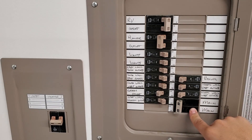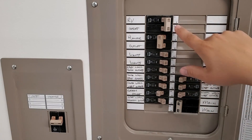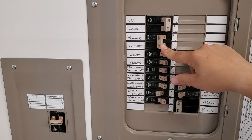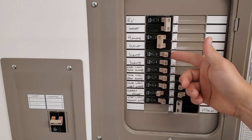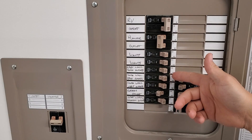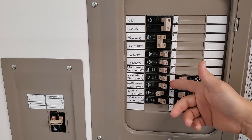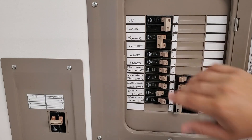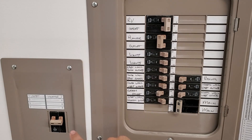That main panel breaker right there is 100 amps. We have an RV outlet that's a 240-volt circuit at 50 amps, and then we have a planer outlet — this is a woodworking shop, so that would be why — that's another 50 amps. And then two 15-amp light circuits. And then we have receptacles: east wall, south wall, south wall, and a greenhouse receptacle breaker. So all receptacles right here, except for the two 15-amp breakers for the lights. Down over here to the left, you can see we have a unit heater, and it's interesting to me that that's separate. I'm not sure if that's separate because it's metered separately or something like that, but we'll find out.